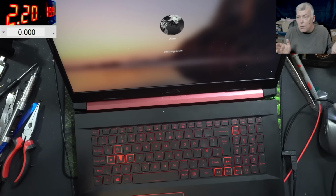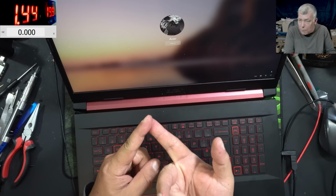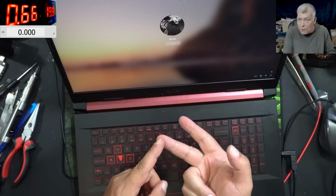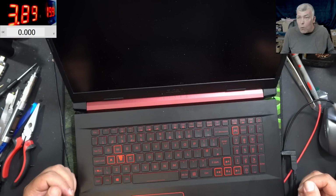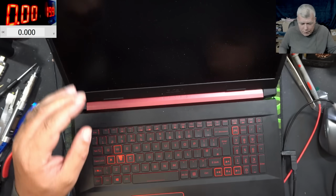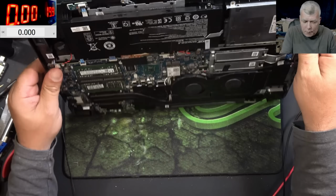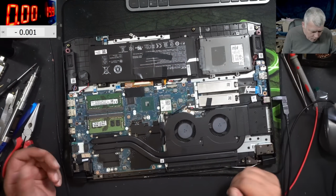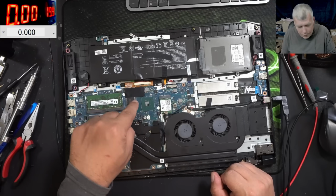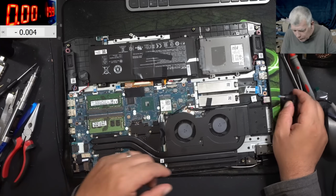I mean, we spoke so many times about the screen signals. Three signals: 19 PWM, or they can have different names, like dim and LED on. All three have to be present. If they are not present, 19, you know how to fix it. But the 3.3 is on the LED and PWM, you just short them to 3.3. Again, I have no idea why it's one pin. It's a pin from the EC chip which is turning the backlight on and off.